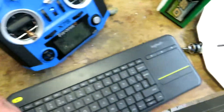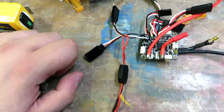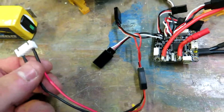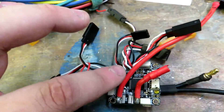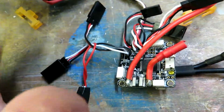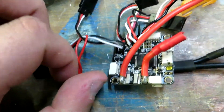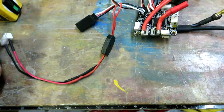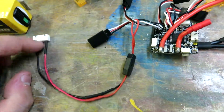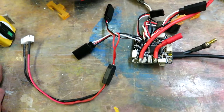Engine disabled - engines are fine. But we have a small problem when I try to fire up the FPV equipment. I have to take the board out and look at this section of wiring. The balance plug goes in here, power goes in, straight off to the camera and video transmitter. Signal goes in and out of the board fine, with a common ground. But the black leads from the camera and transmitter aren't running back to the battery to complete the circuit.